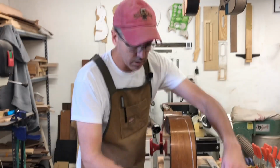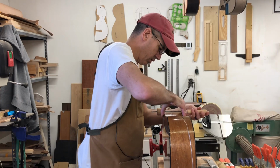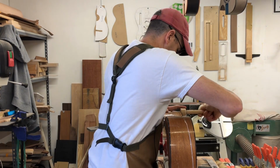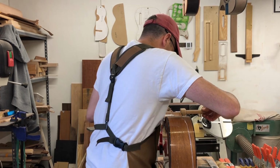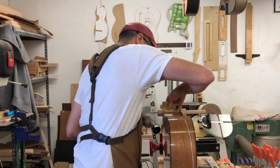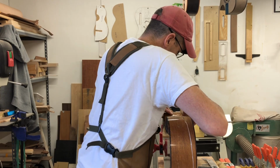So we're going to take, I had these laid out this way. This first one, the spool clamps work great for this. You could also use regular clamps like the Irwin clamps, but you want to be real careful how much pressure you put on here because this wood is fragile. It's dry, it needs to be humidified. And what I'm doing is I'm just working this crack back together as I go.